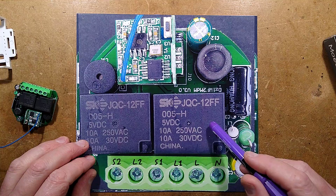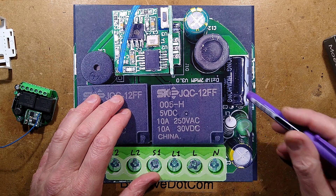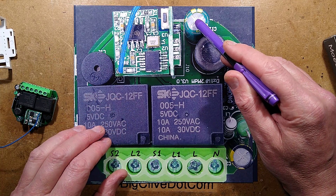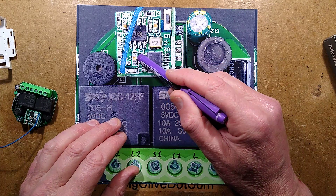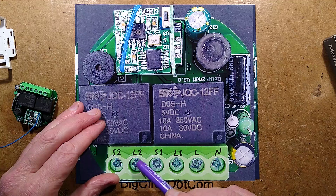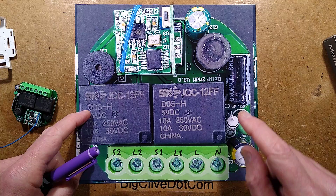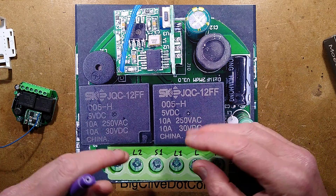Here's the top of the circuit board. It's got two 5-volt coil relays. The incoming supply has a smoothing capacitor, an inductor, and then another capacitor for filtering before the switch-mode buck regulator, plus a fusible resistor. This capacitor is for the 5-volt supply. The little stack of circuit boards turns out to be a 433 MHz receiver, and underneath it is the Wi-Fi receiver. You can control it via a clicky remote control, via your home automation system or phone over Wi-Fi, or connect a switch between live, switch one, and switch two to push buttons for open or close curtains and blinds.